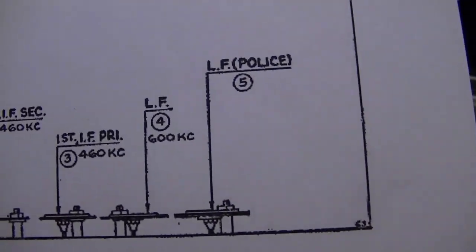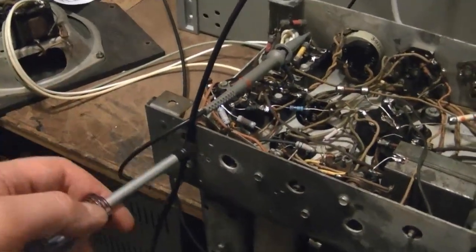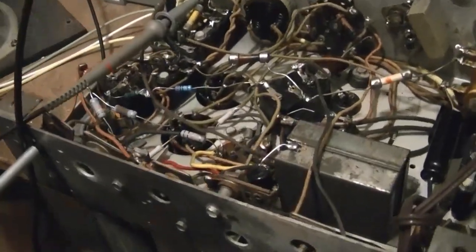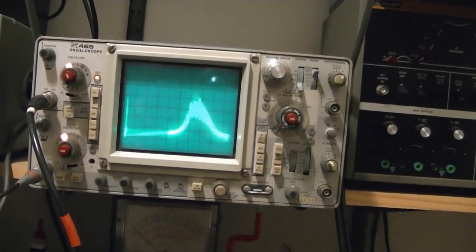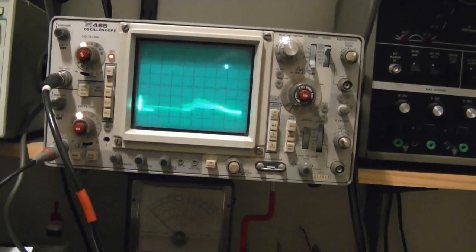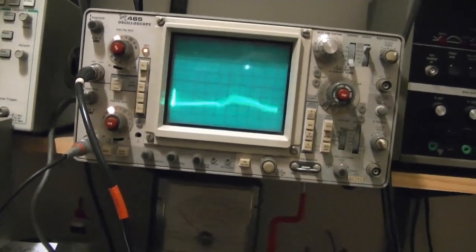Alright, so the first one they say to do is number 1, which, assuming this is the bottom view, is on the far left. So that, I believe, is the closest to the output. So I think the idea is you work your way back towards the front end as you go left to right. So, get that on there like that. So you can definitely decrease the amplitude. It's going to be a little weird to shift it over to the left, because if these are all peaked off frequency, I'm probably going to have to go through multiple passes on these 3 IF trimmers.